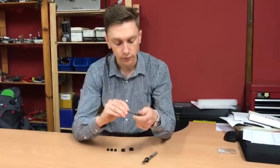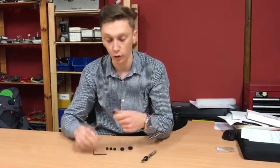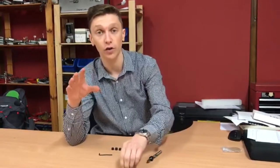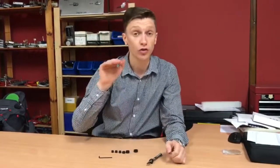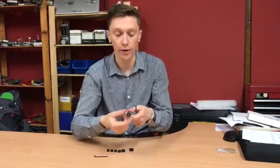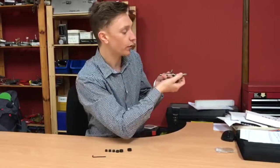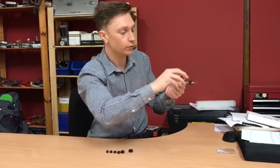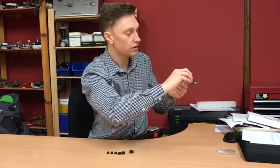I'm going to show you a demonstration shortly where one of my engineers is going to drill open a mortise lock. What he'll do is identify the lock as we've learned from the course, then drill into the wood. As soon as it hits the casing, he'll take the drill out, slide the bit on against the door, push it in so it stops dead, and tighten it up in the groove.